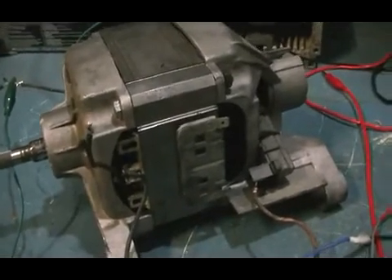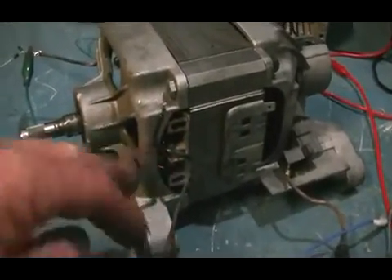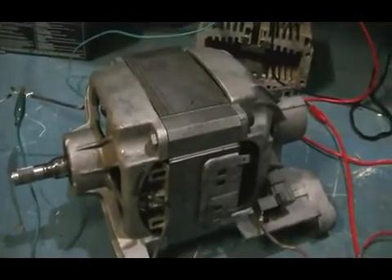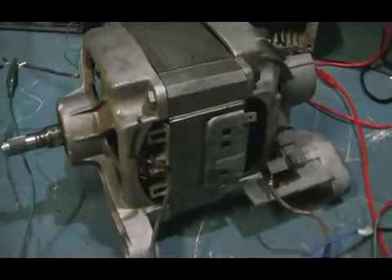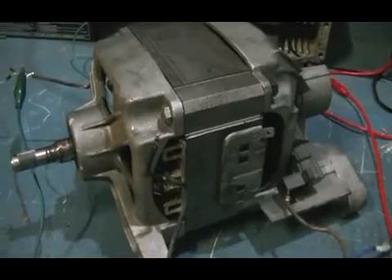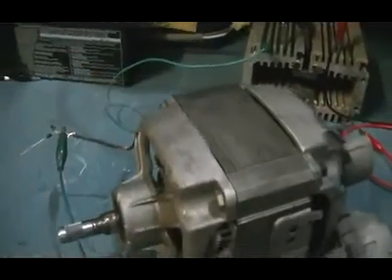I will have to pull this apart again and rewind the coils on the stator. The reason being is they've wound it with around 20 turns on one stator core, then come across and done another 20 turns, centre-tapped it, another 20 turns, and then back over to this side and done another 20 turns. This is not what we need for this setup. When we pull from one coil and hook a load to the other, it's sharing the output to both coils, so one kills the effect from the other. We'll have to put one set of windings on one core and another set on another to utilize both outputs separately.